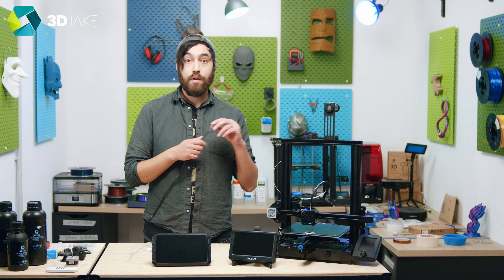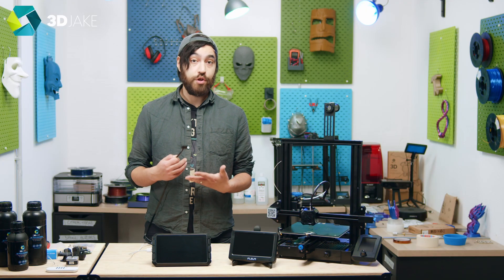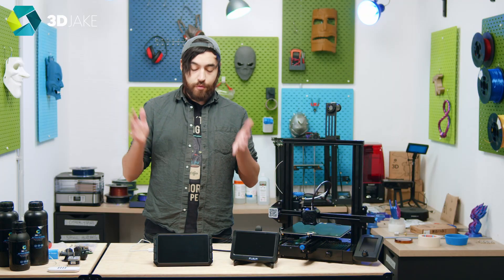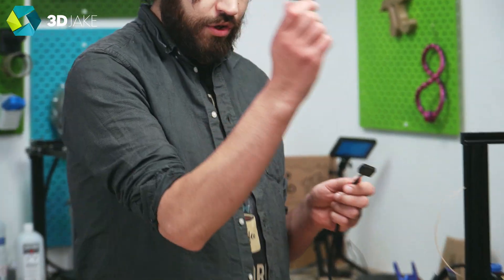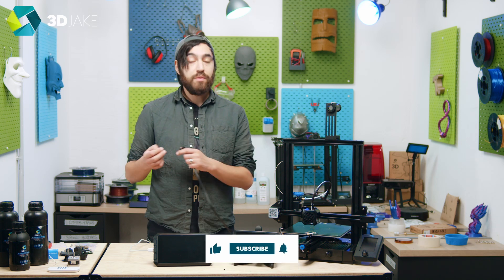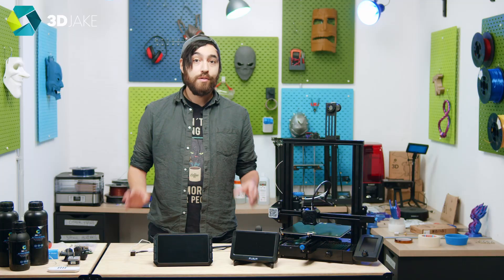The next step is setting up your accelerometer to calibrate resonance control. With this feature, Klipper can compensate for vibrations caused during accelerations and achieve much higher speeds. Go to advanced options and resonance control and follow the instructions. Creality have completely denied the existence of a Y-axis mount for the accelerometer — we actually used a clip with a pretty secure hold. We've also designed an STL for a few Creality printers, link in the description below.